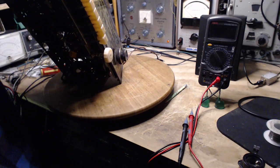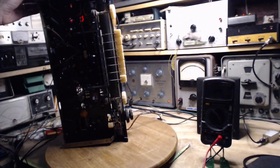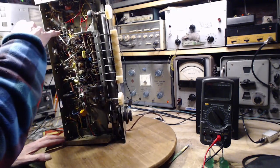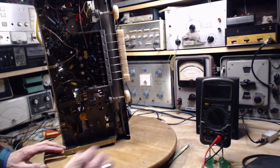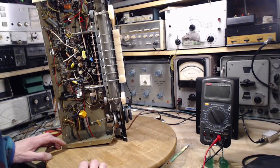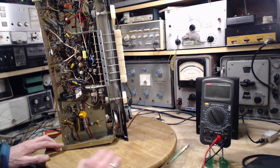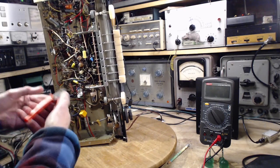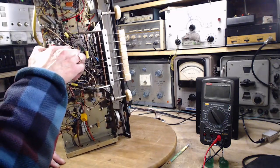Thing is, oh my gosh, if it's easy to change, then it should be done. I think that's the way I should come about this. And there it is up there. You know, that's not going to be too hard to change for the size of it. It's going to be a 2, 3, 4, something like that, microfarads. Yeah, let's do it, because this is low risk in that the worst case is it just doesn't benefit the radio at all. There's not much chance of me ruining the goodness that's there already.